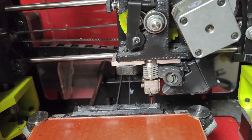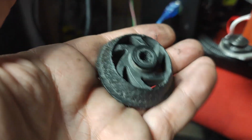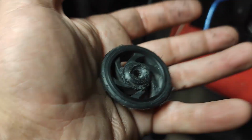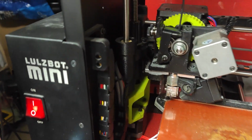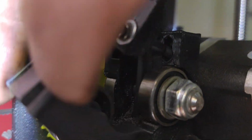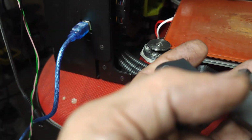Because actually what I wanted is to repair this wheel coming from a traveler bag, which is completely dead and broken, and I guess with ABS it's maybe possible to change it with another one. And so I have had this printer for not a long time now, and I had an issue with this part, which is the idler actually, which presses the ABS wire against the shaft of the step motors behind, and it was broken. For the moment I put just a little glue on it to make the job, but I had to print a new one.